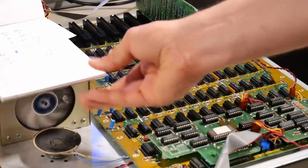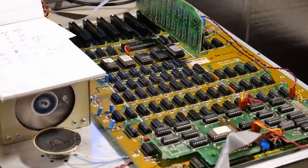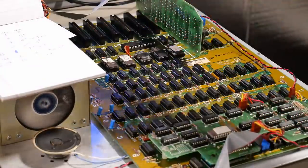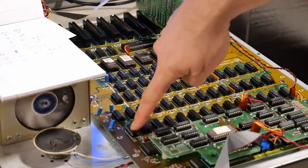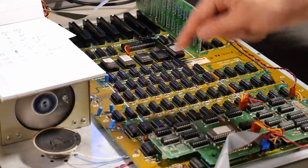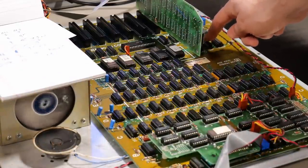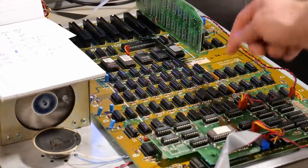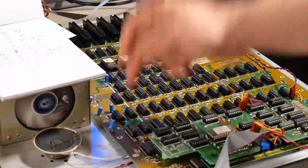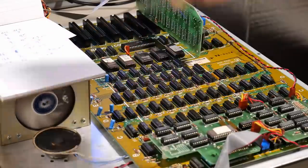Just doing a little reverse engineering on this notepad here took a long time because I don't have the schematics and I'm basically going backwards trying to decipher how the memory decoding works. All right, so what fixed that? I am positive it was this IC here. That half of the MUX was not being enabled, and that was resulting in the memory looping. I am pretty positive that this other IC was probably okay. I don't think there was a problem over here, but this one definitely was causing that particular issue. And it was all from corrosion on the socket, from that mouse piss that killed that pin.